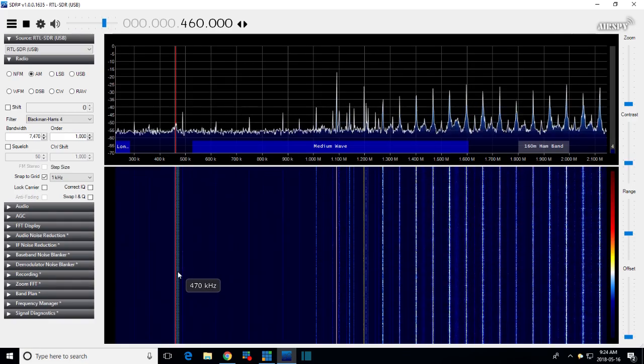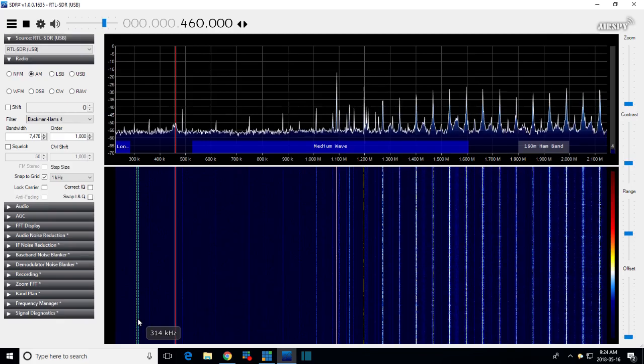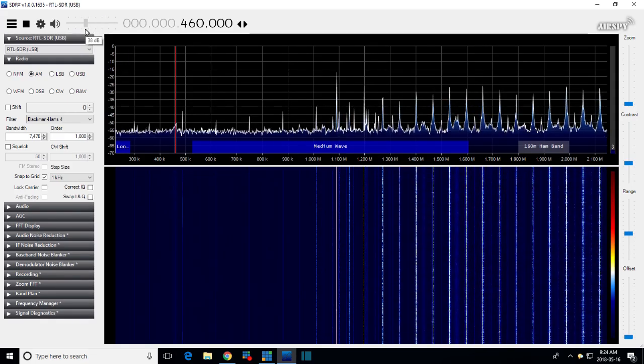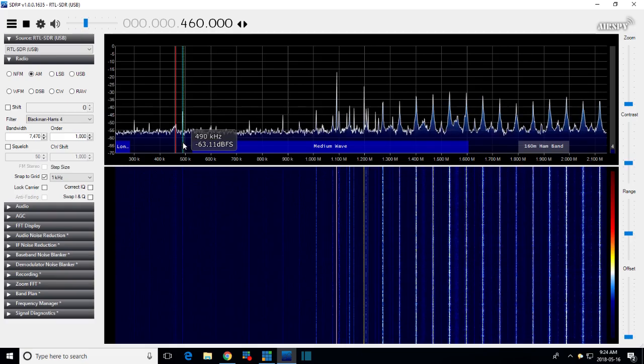It is the same. What I'm doing here is kind of crazy. I'm stealing the IF intended signal out of the... I'm sharing a little bit of it. I'm sampling. That's right, sampling the IF signal and shoving it through another radio with all the same stuff. Well, SDRs actually don't have all the same stuff in them. They work quite differently.